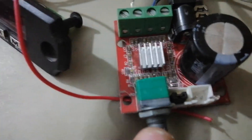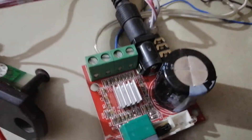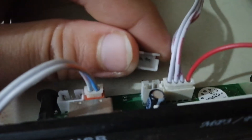As you can see, this amplifier circuit was made in another video where I connected four speakers to it and it worked pretty well — this was the first video uploaded on the channel. It has the same connectors and you can get these type of connectors from such boards. For example, if I had a burnt board of this amplifier, I would take the connectors out of it, along with the heat sink, capacitor, and potentiometer. So you can salvage things from broken electronics. Note these are not the standard JST-XH — these appear to be JST 2.0 connectors because they are really small.